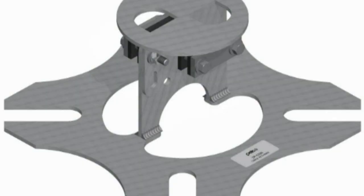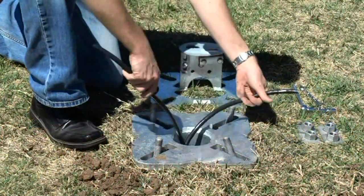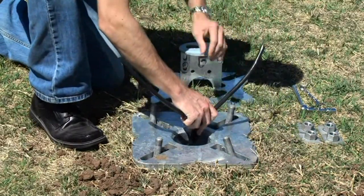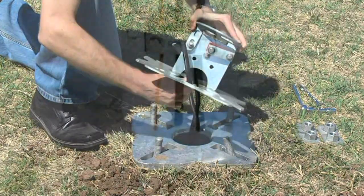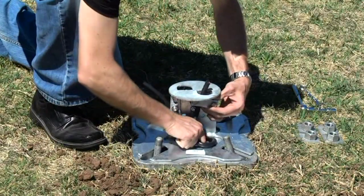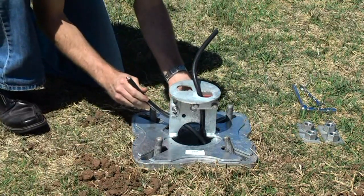This example demonstrates a new installation. The foundation anchor is already installed with the four mounting bolts through the top plate on the foundation anchor. Twist the conductors together inside the foundation anchor. Maintaining the twist, realign and separate the conductors and circuits above the foundation anchor. Up to two circuits with two or three wires can be clamped on opposite sides of the cable retainer. While keeping the different groups of conductors separate, place the cable retainer assembly on the top plate of the foundation anchor.